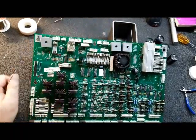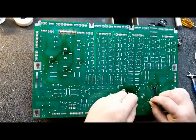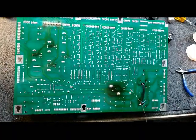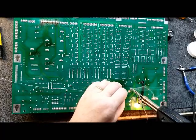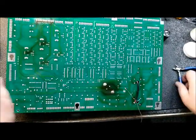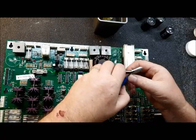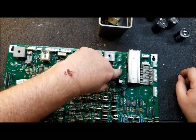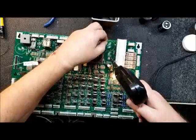There's nothing wrong with the old repair — it worked. Very simple to do should you actually tear these out. You simply take a wire, poke it through the hole, bend it over. I had to sand back a little bit on the trace, get a little bit of that solder mask off. The idea is we do not want to fill up the hole because we still have to put the new capacitor in there.